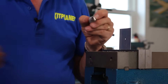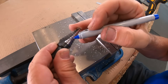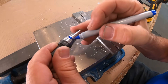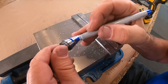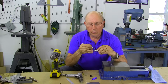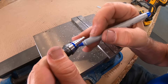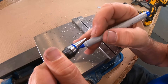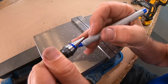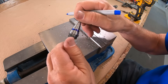And to make sure that we stop where we want to be, we use a Sharpie. Now, you can talk about whether you want to mark the size that you actually want to be, or the size that's one size bigger — it doesn't make any difference. In my shop, I always mark the size that I want to be at and I drill until the color goes through the hole. There are people who do it the other way. You just want to make sure you're always consistent, or you're going to end up with oversized holes when somebody else visits and uses a different technique.